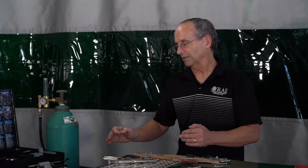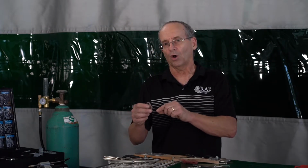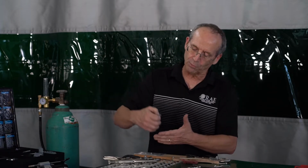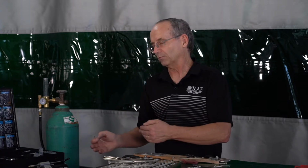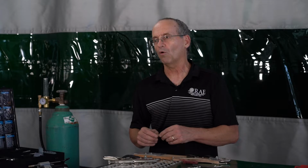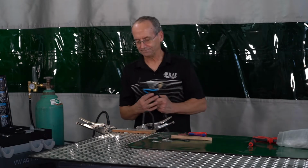If you understand how the process works of the piece lifting up, creating the arc, having the electricity go through, make the heat, have it melt, have it put back together, it makes it easier to use the gun, let the gun work the way that it's supposed to. Don't overforce it. All right, so I'm going to weld another one on.